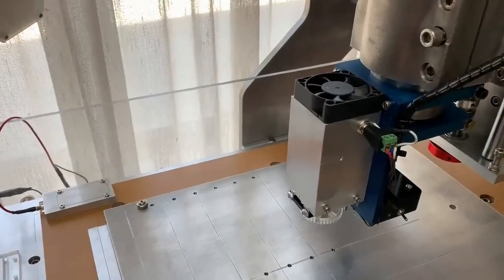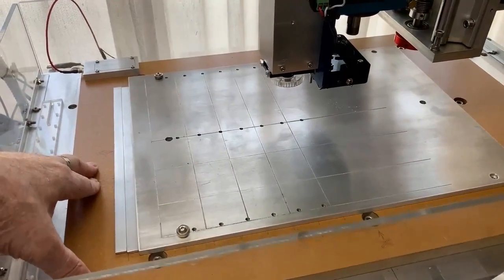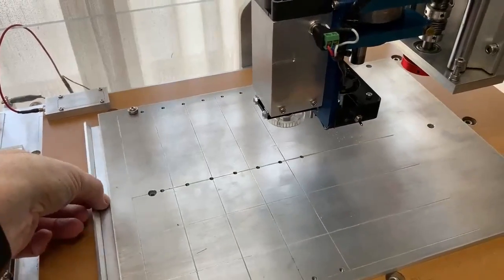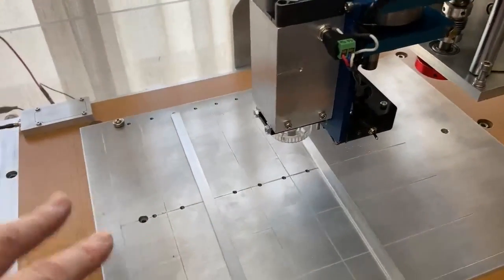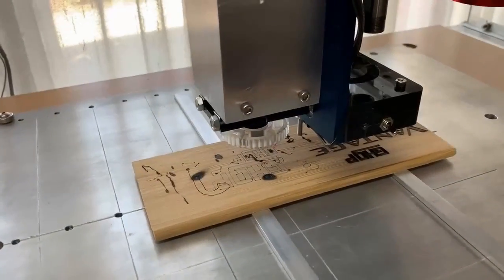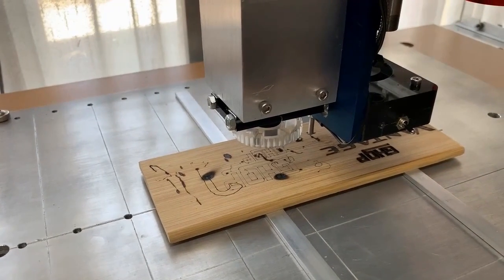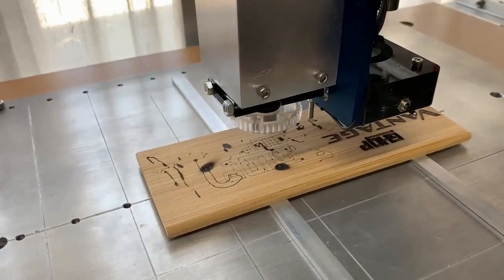When I'm doing laser work, I normally have a spoil board made from MDF on my CNC router. So that I don't burn it, I put a solid aluminium plate on top. If the laser overruns it won't do any damage. If I need to stand the work off I use a couple of thin aluminium strips — I've got more of these which I can place depending on the job. Some of you may have noticed the screw sticking down from the bottom of the laser mount — that's my sensor, so I can constantly set the zero height Z axis to the focus point of the laser relative to the surface of the material I'm going to engrave or cut.